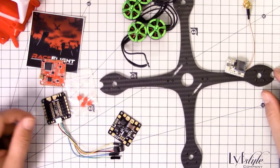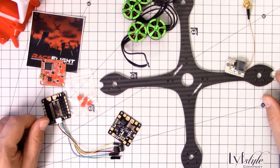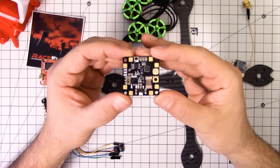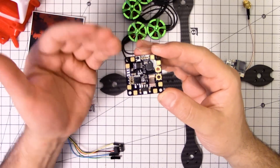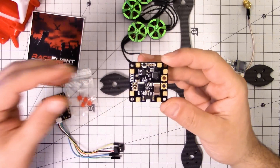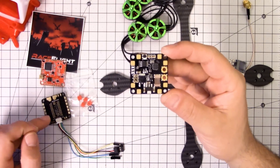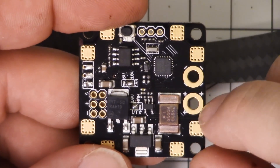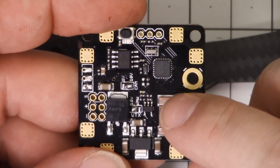Now, when it comes to the OSD, we have a problem. I'm not going to fly a copter without an OSD if I can possibly help it. My first thought was that I would use the Red Rotor RROSD V2, which is out — I've used the V1 for a long time. But the problem is that this pad layout does not work well with a 4-in-1 ESC. In order for the current sensor on the RROSD to work correctly, current has to flow through this shunt resistor.